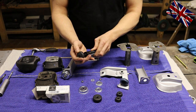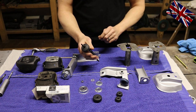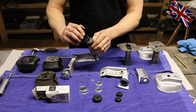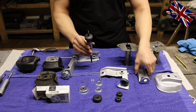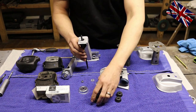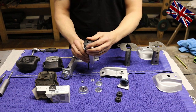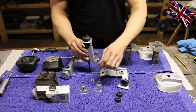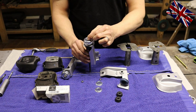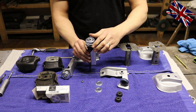Bear in mind that the biggest washer has to go on top to embrace the big rubber dampeners; the smaller ones go to the bottom of the assembly. The bracket is then bolted to the rubber mount. The pin of the shock, which is not retractable, always points to the top. Next step: take a big rubber dampener facing the part number downwards. Next: the heat protection plate facing towards the exhaust manifold. Next: another big dampener, part number also facing downwards. Then the washer embracing the dampener, a small washer, and a self-securing nut. Torque for these nuts is between 8 and 12 Newton-meters.